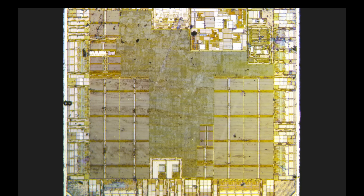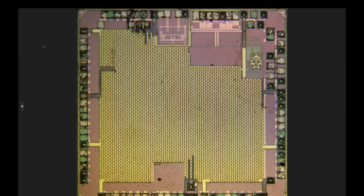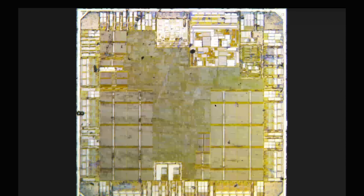There's going to be a boot ROM — and it looks like the boot ROM here. There are two phase-locked loops, one for each processor core; they sit down here. There's an analog power-like function sitting here, and that's probably an analog-to-digital converter. You can see the I/O clusters — they all look the same, because once you design an I/O cell, you just keep placing them down. This little dotted pattern is known as CMP, or chemical mechanical polishing — when polishing each layer, they put little dots down where there's nothing. And we see RP2 B0 also in the polysilicon. So it looks like this is a legitimate RP2040 die.